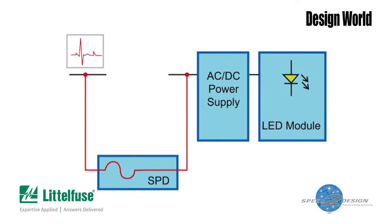Here, you don't need an additional LED to indicate the health of the varistor module. In this case, there's a thermal fuse in series with each of the two power leads coming into the luminaire power supply. So it's obvious if one of them blows — the whole luminaire goes offline.